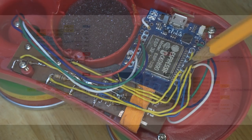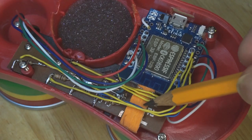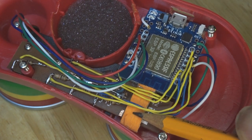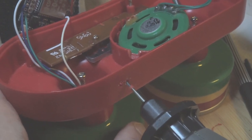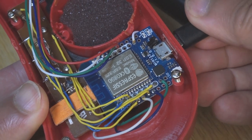So I've soldered the buttons to the input-only pins which lack these pull-down resistors. I've also added a wooden stick to brace the ESP32 board against the rear of the enclosure where I had drilled a hole earlier. This is so when I plug in the USB cable it doesn't push the D1 mini out of position.